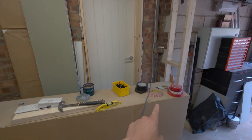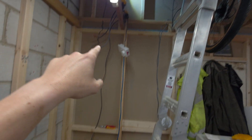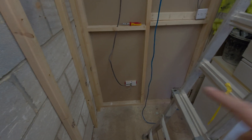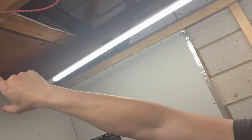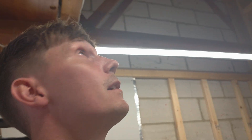This goes back to the fuse board — it came out, went along here, up, round, down, and into there. Because behind there is a gym room and I had to get that going. But now this room and that room will be on the same circuit, so we've pulled that out back to here. We're going to go across here and down the other side of this wall for our first socket. But before we do that I need to move these pieces of wood — old doors sitting on joists — they'll go to this side to create a storage platform, almost like a loft space. The bike has to move too, so we'll get those down and then start the wiring.